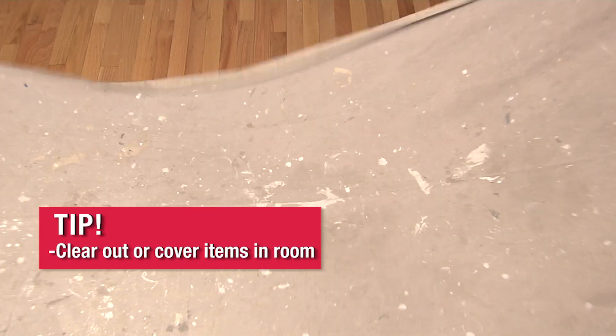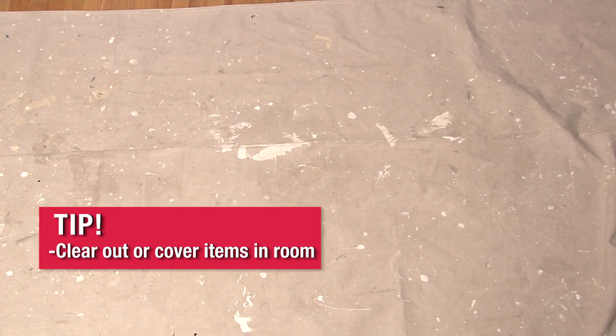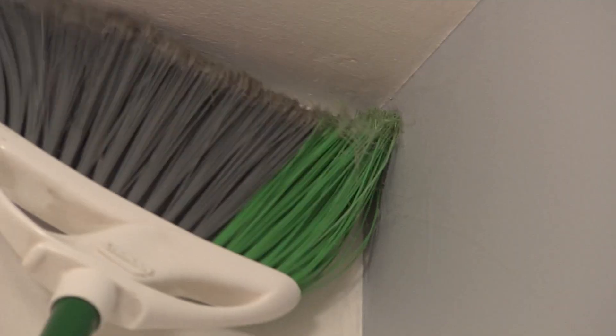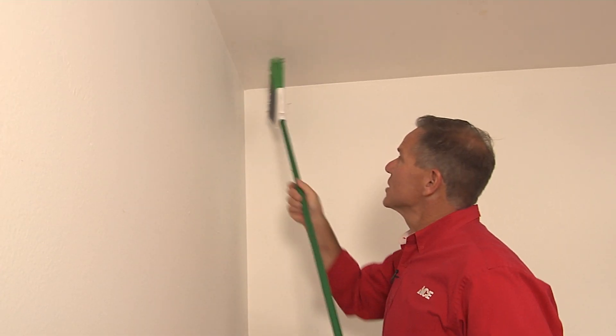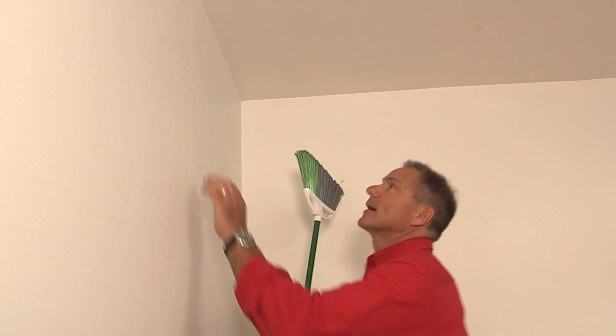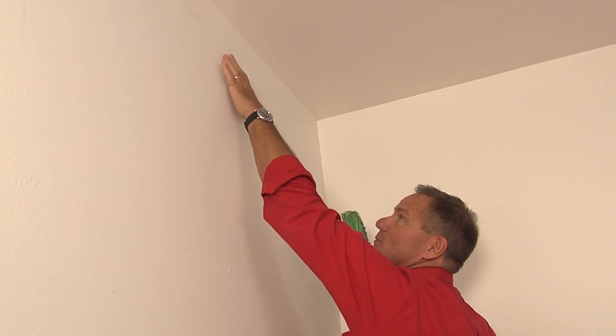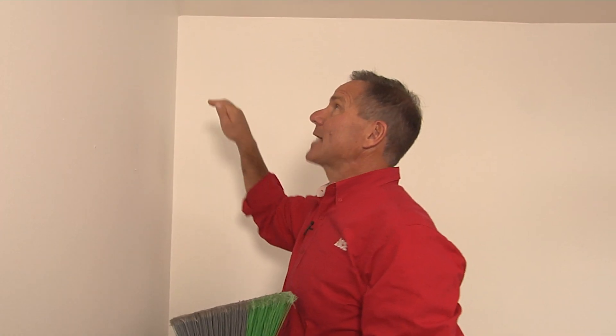Painting the ceiling means you're going to get paint on the floor, so make sure you cover the entire area with a drop cloth. Use a broom and get in those corners — if there's any cobwebs or dust that's built up, you want to get that prepped, as well as the wall coming down. Right here I've got some holes that were obviously there from something that was hanging. You want to patch that using some lightweight spackle.